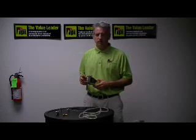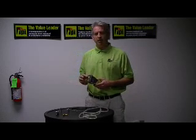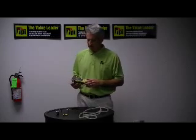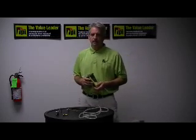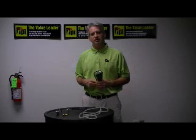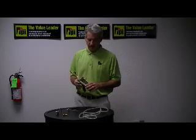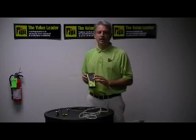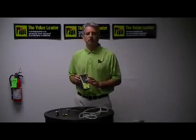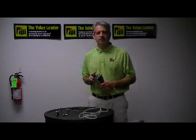This instrument is dual input, so it will measure both negative and positive pressure. It has a mode we call trim mode, which is useful when you're dealing with applications that have erratic measurements of pressure — going up and down. The equal sign indicates trim mode, and you can hit that to stabilize your readings. There are seven different units of measure for this device.